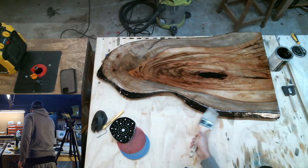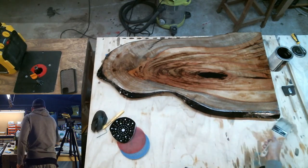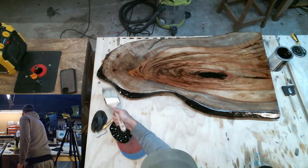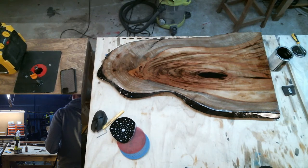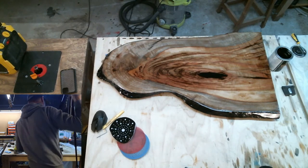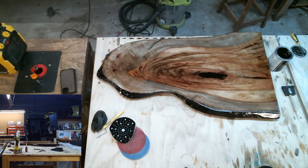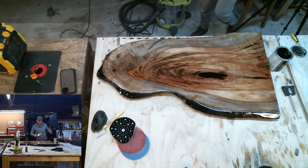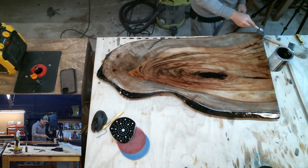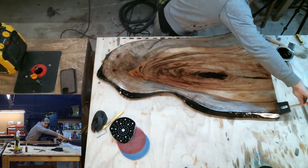Nice. So we have to go over the sides again with the foam brush. Get rid of all the brush marks I did. Okay. Oh, that looks horrendous. Okay, I'm not sure if I'm gonna be happy with that poly. Very suspicious that that doesn't work properly. Okay. So let's go over it with the foam again. Just on the sides. So all the brush marks are gone.